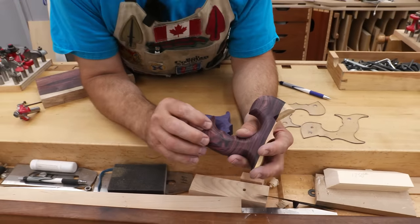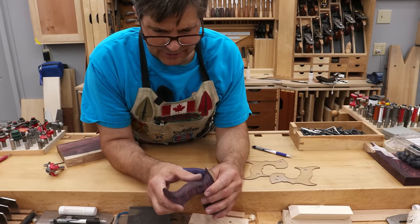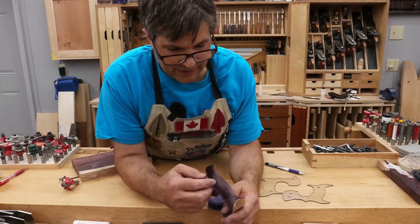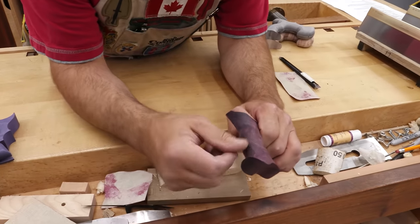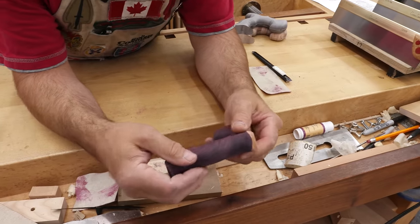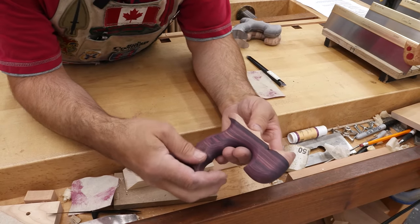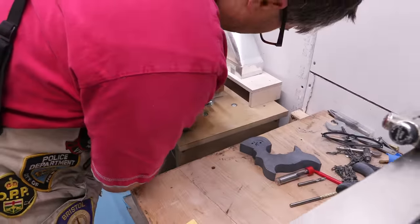Now comes the slow part — this has to be all sanded to finish. I used to do it with a flap sander, but I didn't like the way it makes things kind of muddy. I like nice sharp edges. I used to cut the slot first, but what I found was in the sanding process you would lose that nice crisp edge. You want that to be sharp so that when it meets the brass, it's a nice tight fit. So I'm going to do all the sanding first, cut that slot after the sanding is done, and hopefully that'll preserve that nice sharp edge. I'll start with 120 grit — there's just a little bit of tear right there — you can't see it but you can feel it, so better to start with a coarser grit.